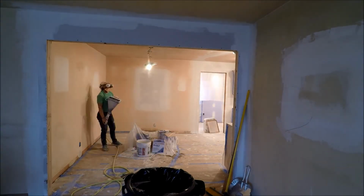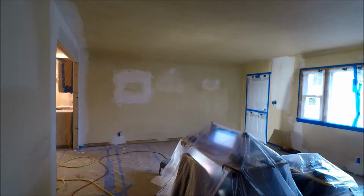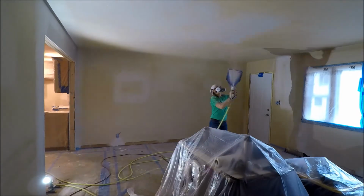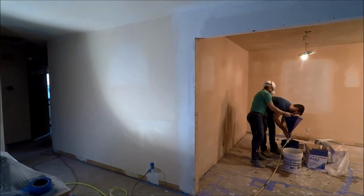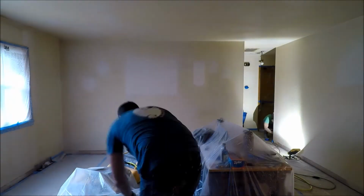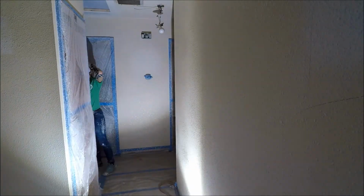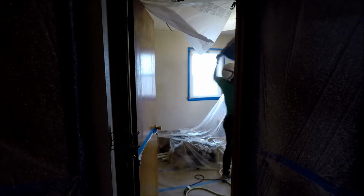That was exciting. That felt good. Accomplishing. And it really unifies everything, especially when you're bringing together new drywall and old drywall and patching holes in drywall. It really makes the eye disappear across all the transitions. Ooh, it's really good here on the ceiling. Since the ceiling was so yellow, you can see the texture coming across as I spray it. Oh man, and that funnel got kind of heavy when I would load it up with the mud.